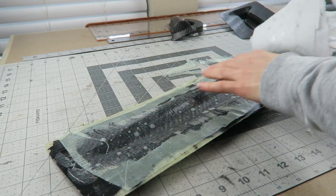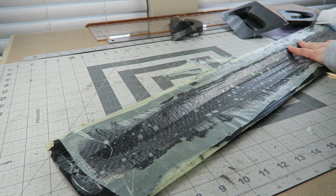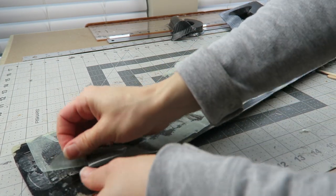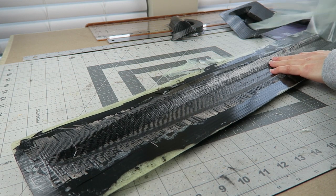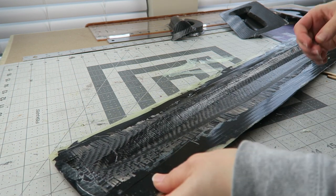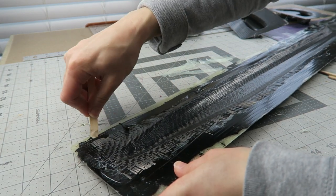The blade is the easiest part to release because it is a lot less complex than the other two pieces, so we just peel away the breather cloth and the peel ply, and loosen all the edges so it can pop right out.